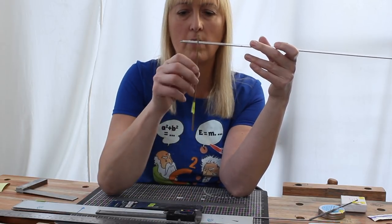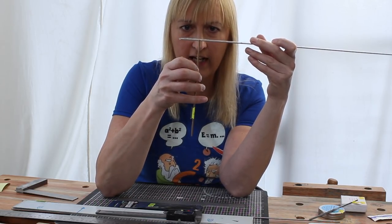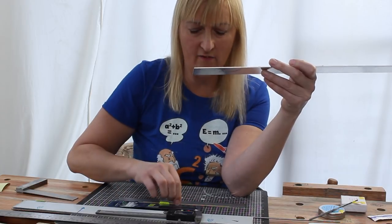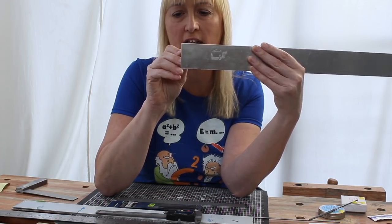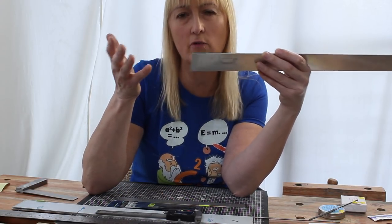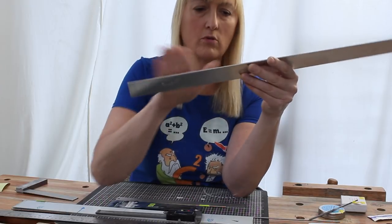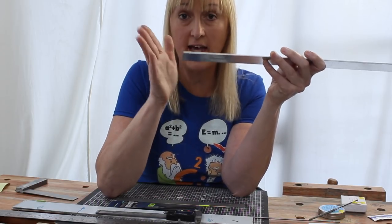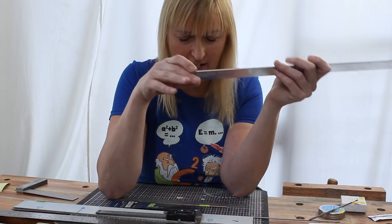We've got to make sure that the mitre jig is set up precisely, not just to cut square, but also to cut in exactly the right spot relative to the locating peg. A much easier way of doing it is to have, in effect, a zero fret position marked on the template. So we have a little notch somewhere near the beginning of the template, and that notch corresponds to our, let's call it our zero fret position, but effectively the position of the nut. And then when we take the fretboard out of the jig with all the slots cut in it, we then cut through at the zero fret position to create the end of the fretboard, and then we know that everything is measured correctly. It's all relatively measured correctly.